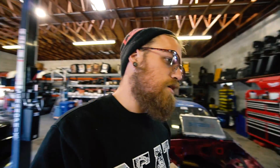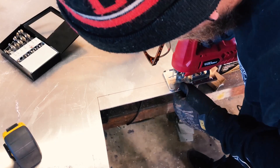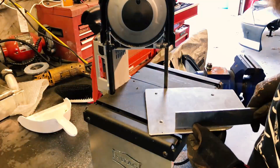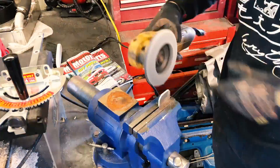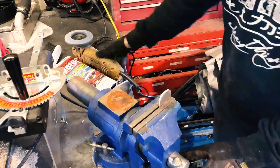The only thing is how to do a handle on top. My original plan was to do like I did with the Vette — weld threads to the top so I can thread a shift knob on it and have a knob. I think it looks clean. However, with aluminum I'd have to find an aluminum bolt, which I'm sure is possible, but I'm not quite sure how exactly I want to go about that. Regardless, tabs and handle are the next steps.